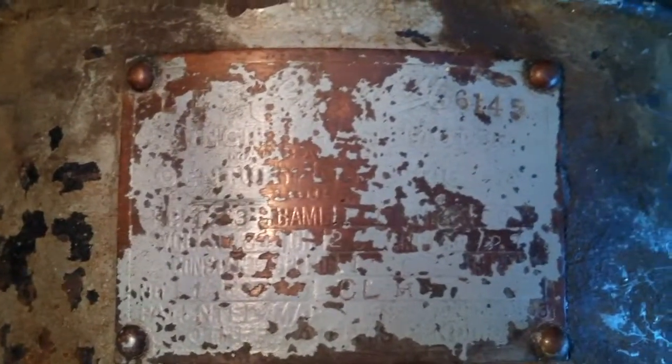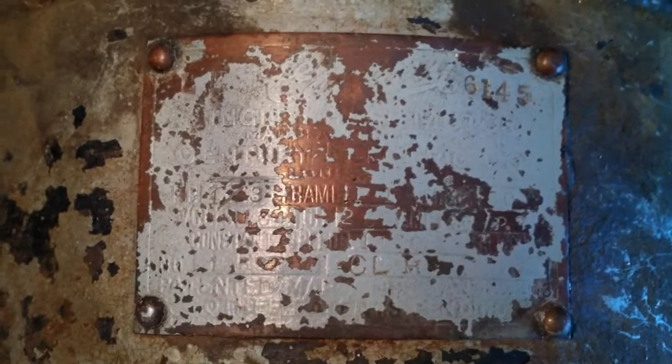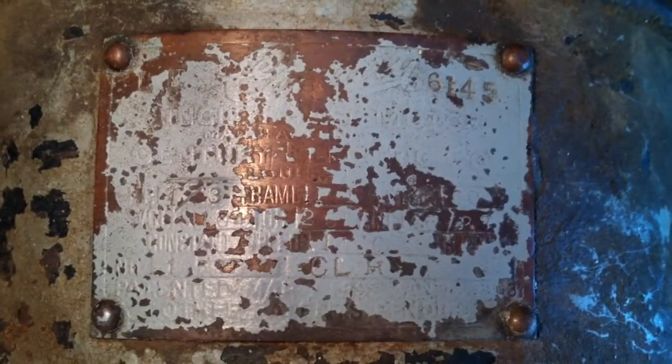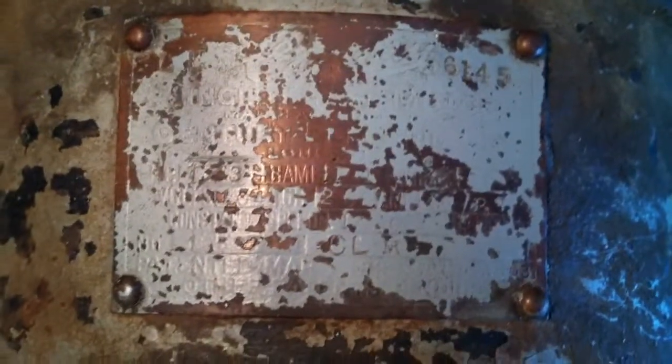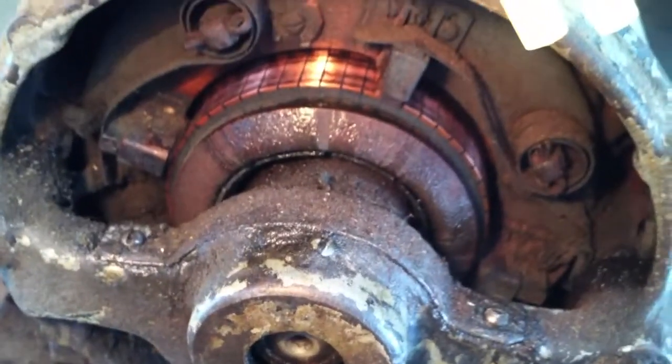The nameplate is pretty good except someone painted it. It just says 'Sentry single phase motor' — it doesn't say anything about repulsion. It obviously is some variety of repulsion motor, but I actually can't tell if it's repulsion start induction, i.e. brush riding.